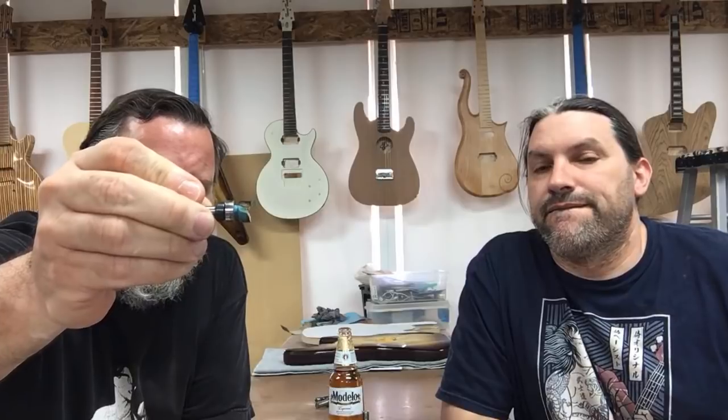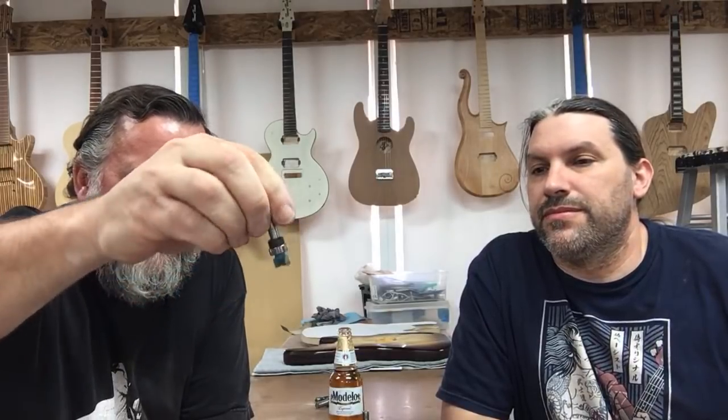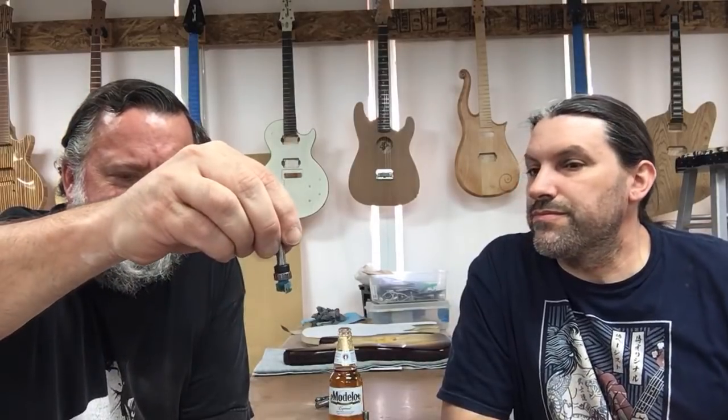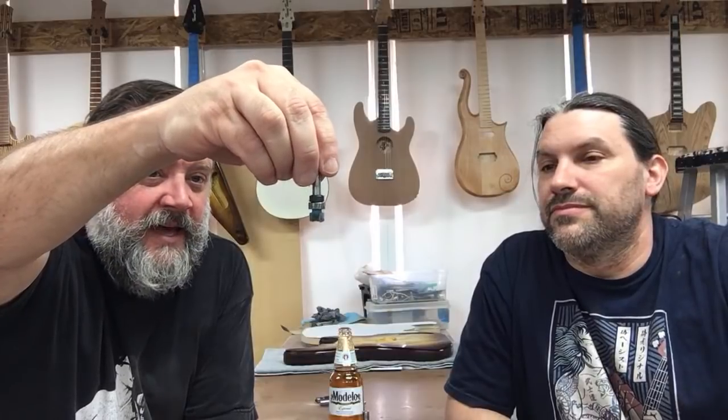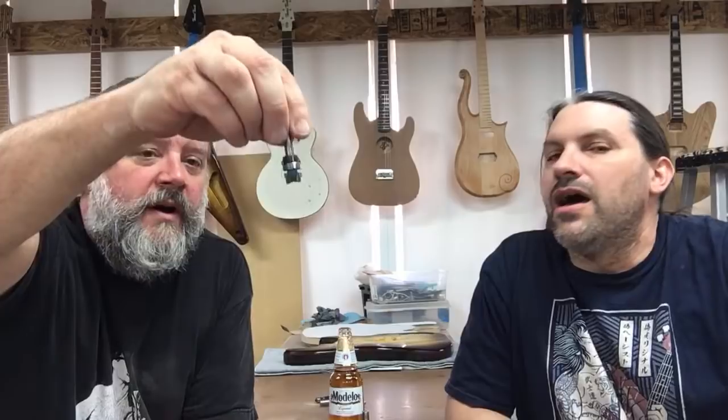This is a door hinge router bit. It's got a really small cutter on it and doesn't go very deep at any given time. If you had a template on top of the guitar and you just need to go in a little bit to get started, you don't want to use a big bit. We use this one for putting in control cavity covers and things like that — it works really well for stuff that doesn't have to go very deep. It's also a great one for deepening neck pockets — if your neck pocket needs to be just a tick deeper.